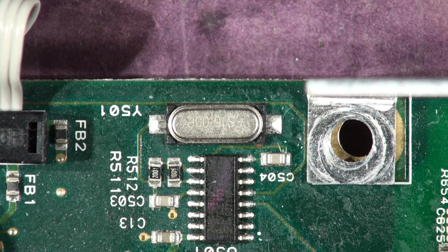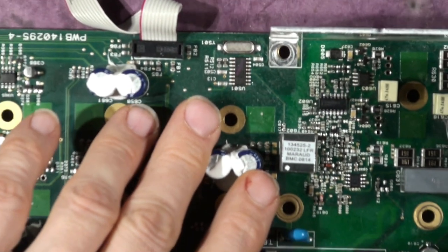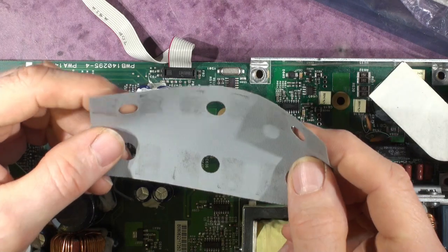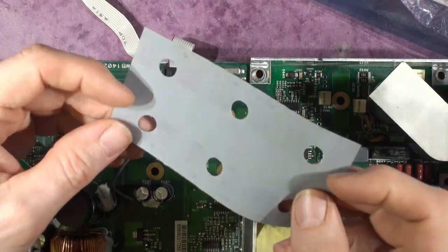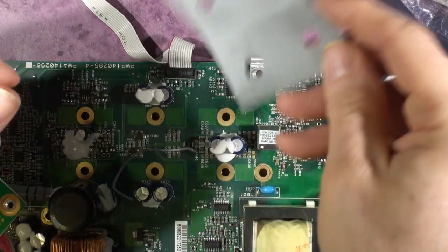I'm going to go through and change all that stuff — hot air gun, solder and iron. If you want to see how to do the soldering and component changing, just have a look at some of my other videos. If you've got one of these and you follow those steps and carefully replace the items, look at the other videos about how this is mounted back onto the metal work and the heat sink. Because there are these evil insulated pads that go behind the transistors — sometimes you get little bits of swarf trapped in there that punch through and short the transistors onto the heat sink, which is not fun.